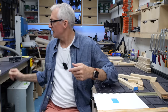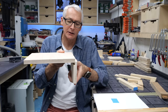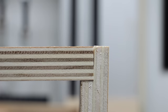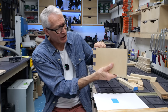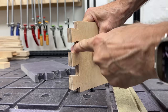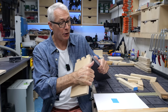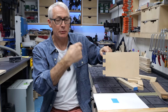Not all joints are about getting more gluing area, although that is a consequence of them. Something like a rebate or a rabbet has physical properties too — it has a little lip where, if you're making an L-type joint, it actually supports the material. And things at the other end of the scale like dovetails, where the shape of the tails is extremely strong because it won't pull out in that direction — there's only one direction it will come out. It also has a huge amount of gluing area inside the tails and pins when those two mate together. The same goes for box joints, which are basically like a dovetail but with the pins straightened out — they're popular because of the large gluing area, making for a very strong joint.